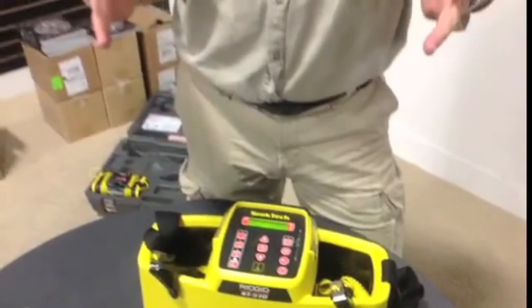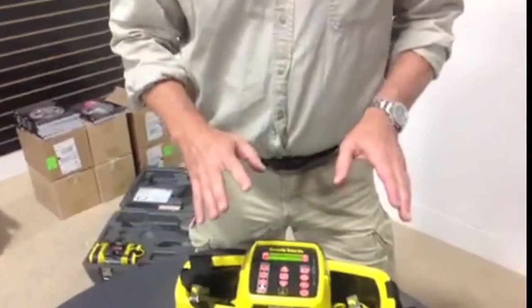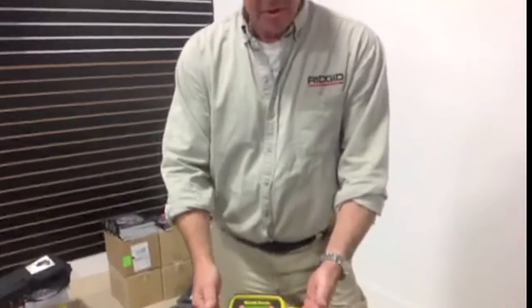We also have 262,000 hertz, which is very high energy but dictates a lower wattage due to FCC rules. The typical end user for this unit would be someone doing pipeline or water supply cast iron, large diameter work — going between hydrants and services with large exposed pipe diameters. This is the tool where the additional 10 watts of power capability would make your locates and your life easier. Thank you.